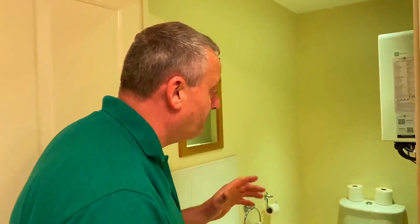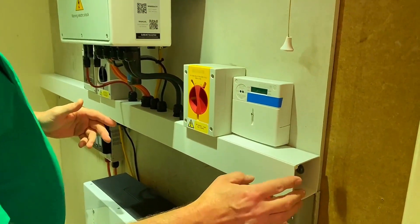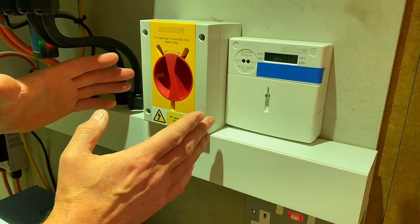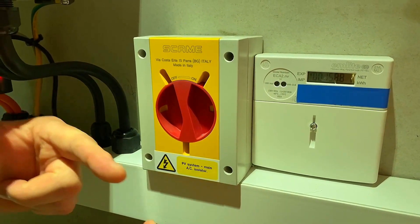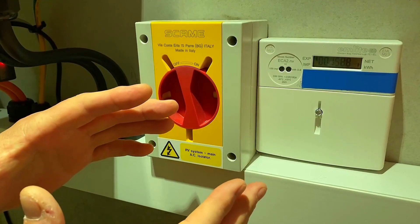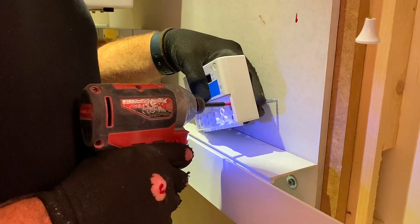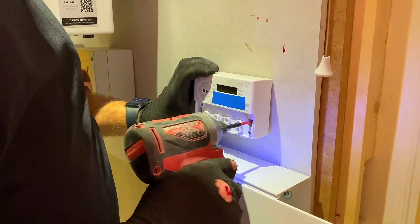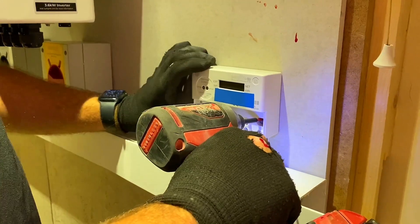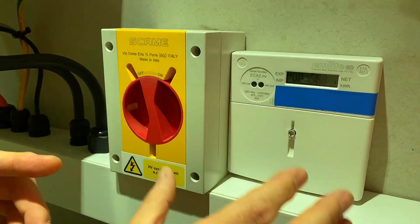Time to see inside my plant room. I've had a few modifications done recently — I've installed a toilet and basin, making it a multi-purpose room. Let's go through the kit installed in here. First, there's the AC isolator: a cable comes from the consumer unit feeding this room, but it also works in reverse, taking AC energy back to the consumer unit so I can power the house from solar or battery. Next to it is the kilowatt-hour meter — something I didn't want, but under the MCS agreement Sean needs the serial code from it to register the job.